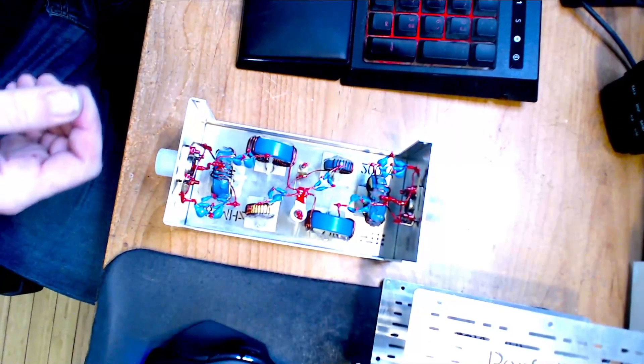They have a zip tie and hot glue to keep everything where it belongs — so this particular one is pretty complex, though not all of them will be that way. I wanted you guys to at least see what's inside a bandpass filter to get a better idea of what you're up against if you want to build one. Now, if we can find cheaper, easier plans that don't require as much as you're seeing here, or maybe they do — we'll have to figure it out. If we come up with a viable solution, we'll definitely let you know. I've seen other simpler ones that were basically two SO239s, a toroid with copper wire wrapped a certain number of turns, and a couple of other components, and they worked just fine.